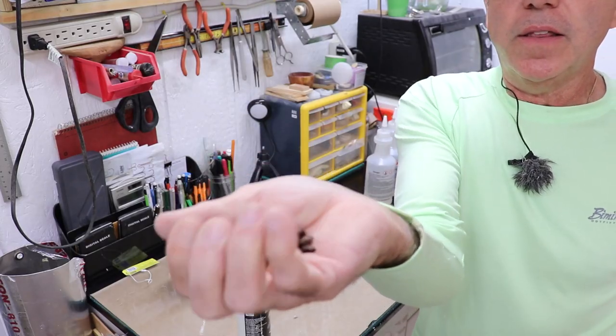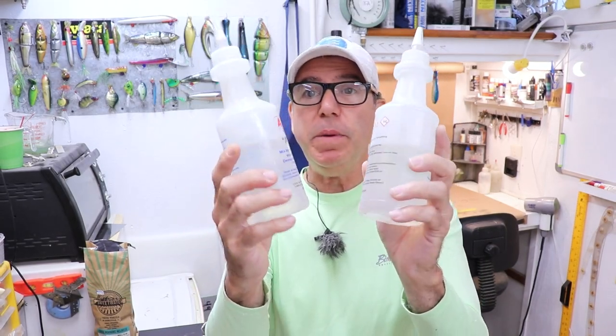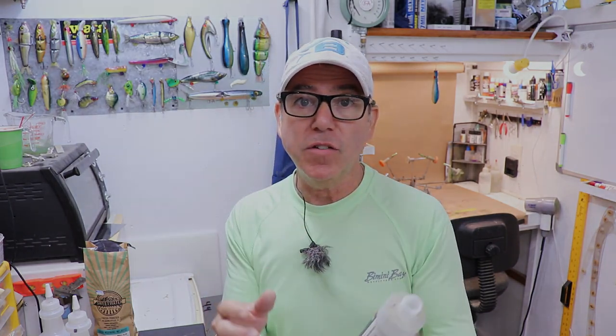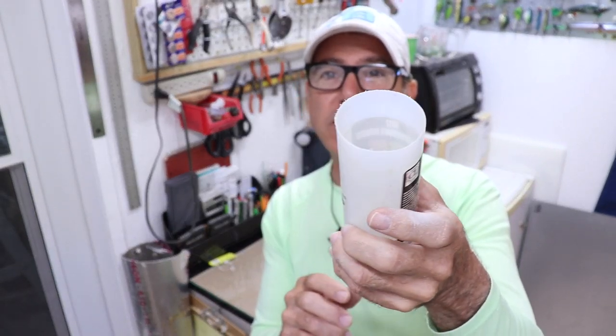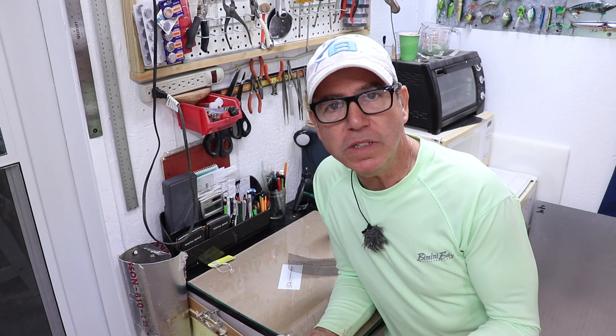The coffee is delicious. I've got one thing I'm not sure about — this whole design is gonna be dependent on what I assume are floating coffee beans. I don't know for sure. I think they float, but let's try it. And there they are — oh yeah, they float. So the plan is to encase the coffee beans in some clear resin and pour that into a mold using this old container, creating a blank that I can then take to the lathe and shape.